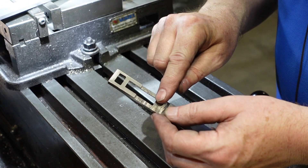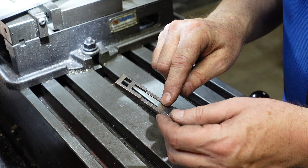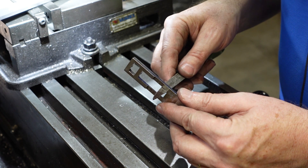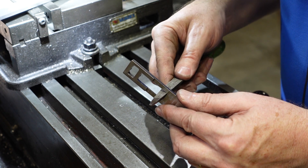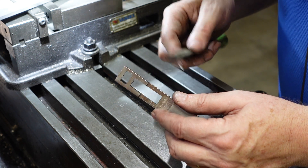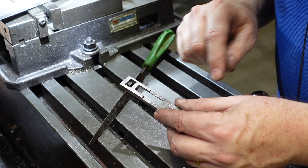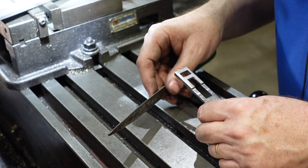The other tip is that to get right into those corners, you won't get a file with a square corner that will give you a perfect square corner. So what I tend to do is use a triangular file — use that to take out the bottom and then just neaten up the sides with the triangle. If you go too far you can see it, but if you just give it a light touch it looks like you've got a nice square corner, or at least as square as the edge of the triangular file is going to let you be.